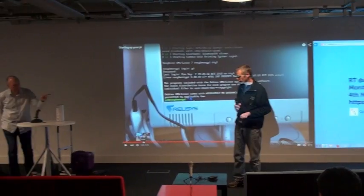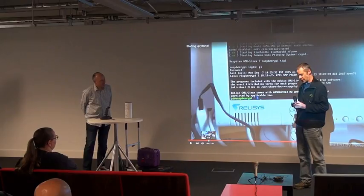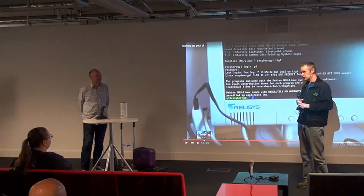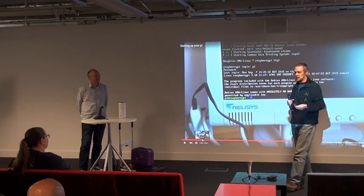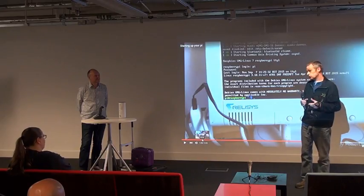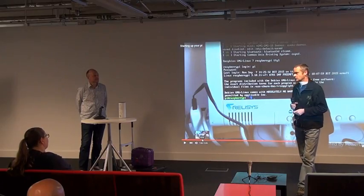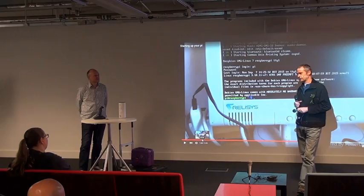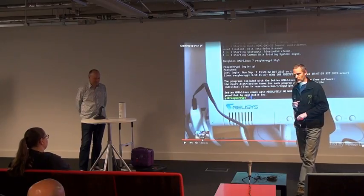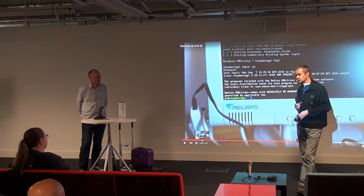If you're using a power supply that's not powerful enough, will the Raspberry Pi work at all? It'll work, yes. So it'll work just as it is. One of the key ways of finding out if the power supply is the issue is to disconnect everything else you're not using. If it's powering a screen, or things like USB mice, those will draw a bit of current. Disconnect as much as possible. The Raspberry Pi will work in a fairly basic phone-type charger, but it will struggle more as you add more things. The key thing is to remove things and see where the problem goes away.